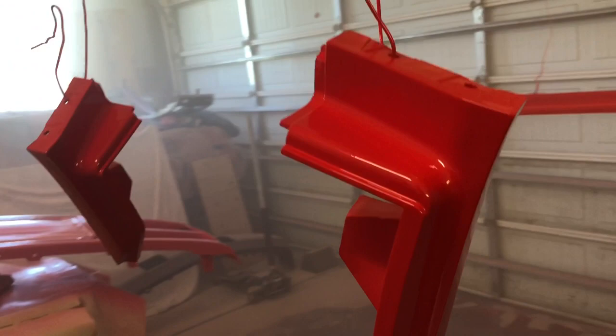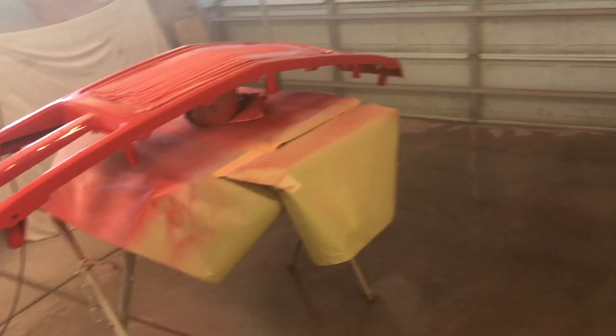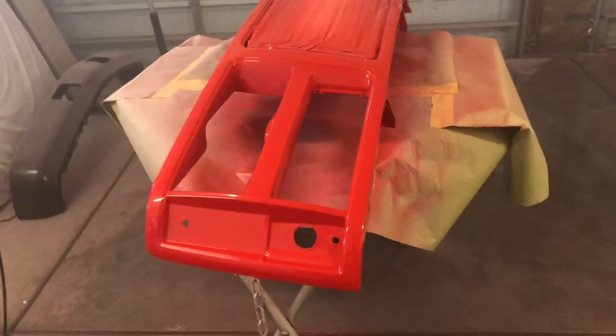To me the key to this whole thing is keeping the floor wet. If you keep that floor wet — keep your hose in there and keep spraying every time it looks like it's starting to dry up — you keep the dust on the floor and you won't have any particles floating around or any trash in the parts. I'm going to let this dry for a little while. I've got a little fan and filter going trying to suck up some of the overspray, then I'll bring the parts outside when they're dried up enough to sit in the sun.